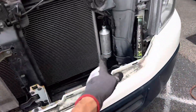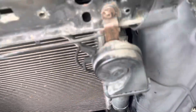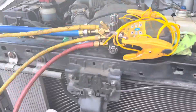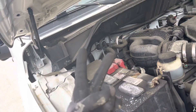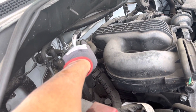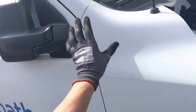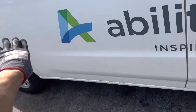There's the receiver dryer with new o-rings, and a new compressor down there. I put in about one ounce of oil because I know all the oil is stuffed up in the system. This is a dual system — you see this pipe right there, and that other pipe tapped into a T right there — because it has two evaporators.